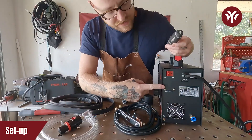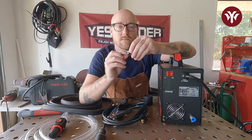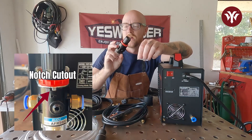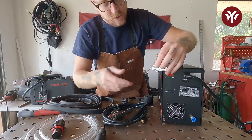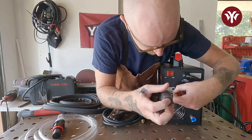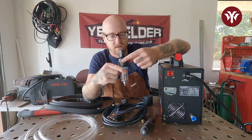So let's go over how to actually put this together to start off with, and then let's cut some metal. To start off, we're going to remove these two screws on the back. When you're installing the actual retaining ring, the direction does matter. We have this little notch right here on one side, and that's going to be wanting to face down because it is going to meet up with this notch cut out right here. So when we're installing it, we're going to make sure the tab is up and the notch is down.